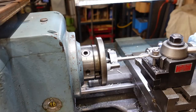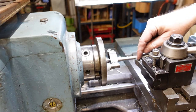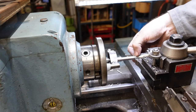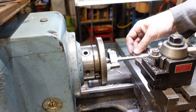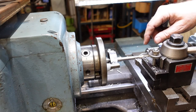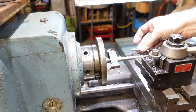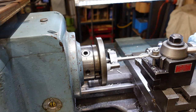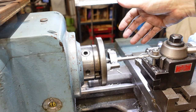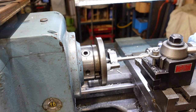I'm making up a mandrel to turn my worm blanks on. A trick I'll share: I've used a parting tool to take this down to finished size — there's going to be a thread there so it doesn't matter too much — but as you can see the tool doesn't fit past the center. By extending the center I can avoid the tool striking it. You can also get extended centers from a removable set for more clearance, but this is quicker for a one-off. I'll turn that down to size for the blank and then put a thread on there. Apologies for the rain coming in.